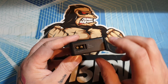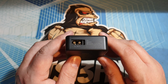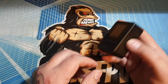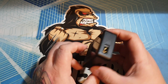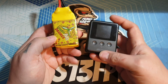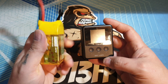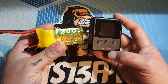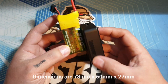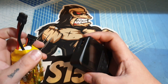On the top is your input — again XT60 — but there's also a USB-C. The USB-C on the top says 'PD input and out', so you can actually plug a LiPo in at the bottom and use that USB-C to charge your phone. Just to give you an idea of size, I'm sure plenty of you know Speedy Pete's LiPos — this is a 6S 1200 and you can see the 608PD is maybe a bit wider or a bit thinner, just as a rough guide to show you the size of it.